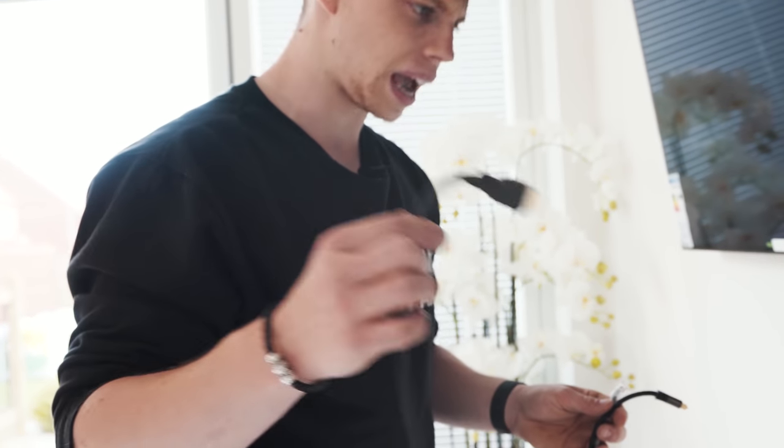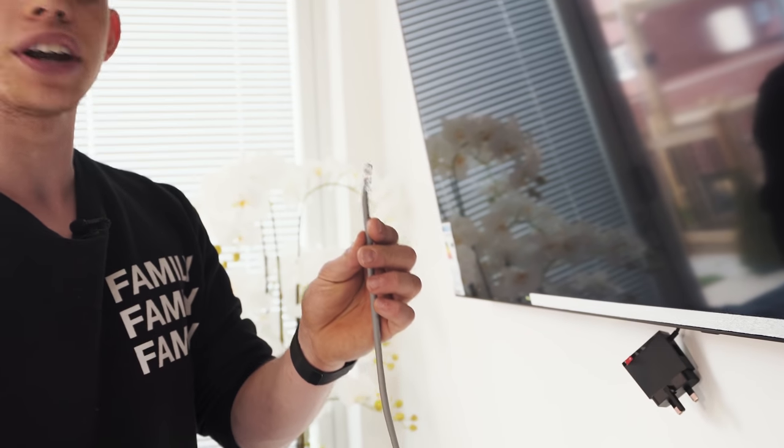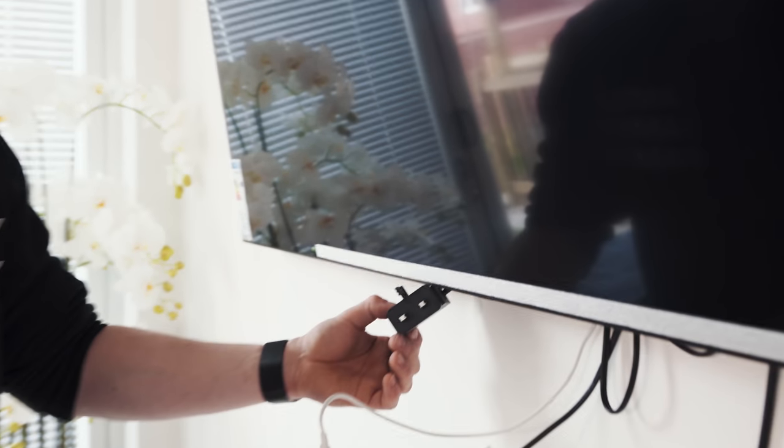These are essentially all of the cables I've already got run for the TV that was here before — they'll still work with this TV. We've got a single HDMI cable. I wish I'd run two; if you're ever running HDMI cables to a TV, always run one extra. One of these cables goes into the understairs cupboard so you can plug things into the TV. We've got an optical cable that plugs into the TV and feeds down to the KEF speakers, so you can use the 2.1 KEF setup. And we've got a CAT6 Ethernet cable going into a switch in the understairs cupboard, giving the TV wired Ethernet backhaul for all smart connected applications. We've got power for the TV, for the LED strips, and for the Chromecast 4K on the back. It's on the wall and it hasn't fallen off yet, so — touch wood — this is going to go well.